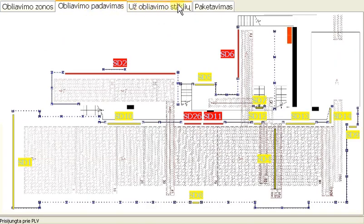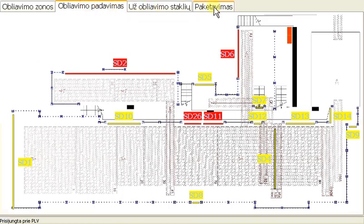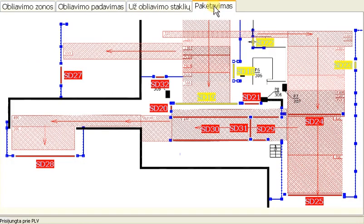Yellow color means the zone is not triggered. Red color means the zone is triggered. The SCADA helps the operator quickly determine which zone is preventing production from running, significantly reducing stoppage time, as the operator does not need to visually inspect all safety zones of the line.